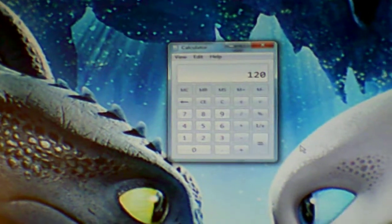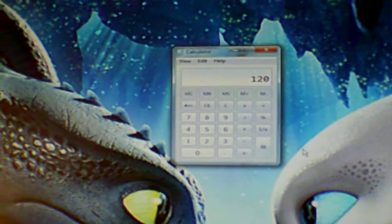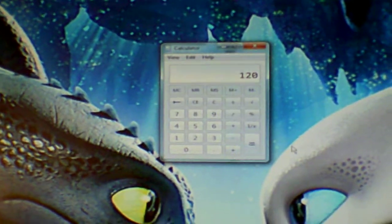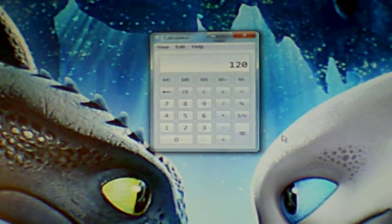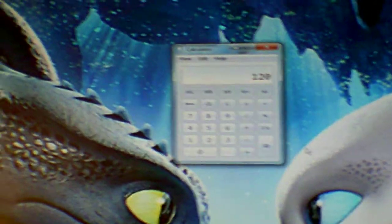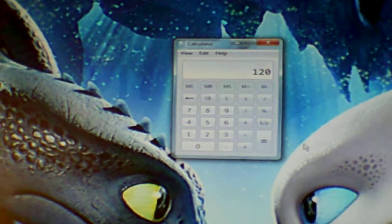And then it will kick on one time in the middle of the night when it's the coolest outside. But it will run one time. And that can be anywhere from 2 to 3 in the morning. And then it'll kick off after a half hour. Running this 4 times a day should keep my food frozen once that deep freeze has already been frozen up.